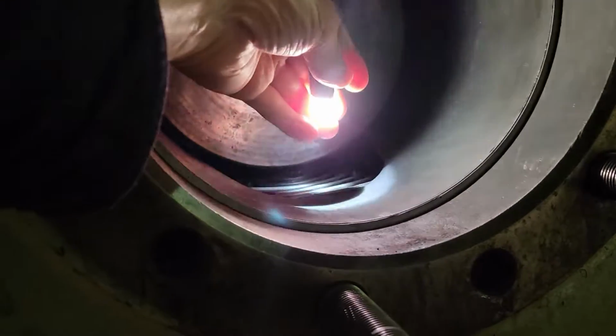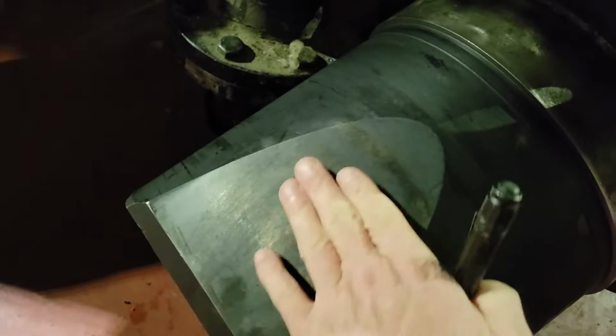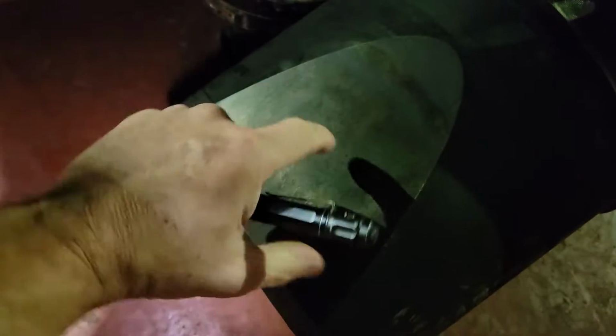Notice how this area, the piston actually extends out right above the valve, right? And then the end of this is sculpted here to align with where the valve is positioned. This is sealing the end of the cylinder, and then this sculpted part is allowing gas to come in to get into the valve, through the suction valve, and then into the discharge valve.